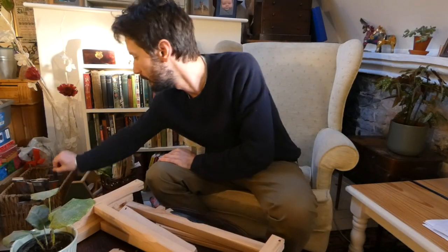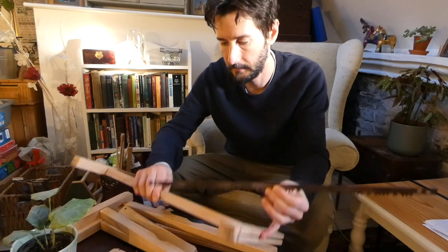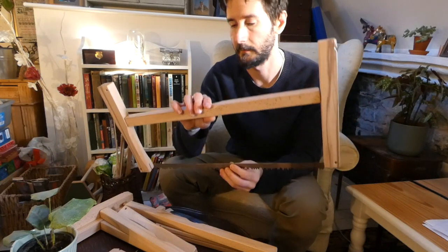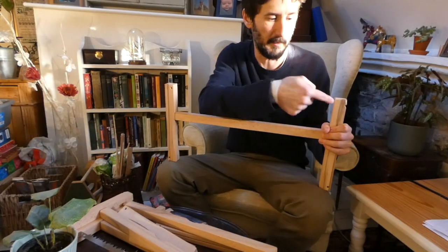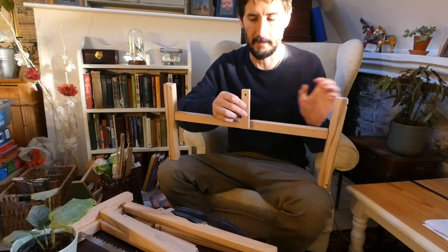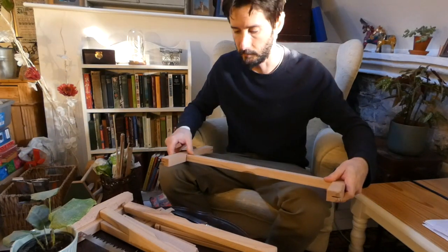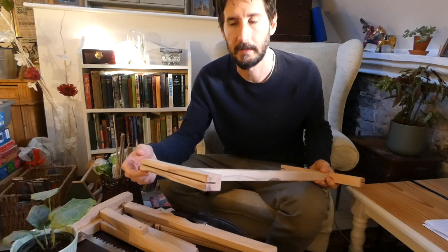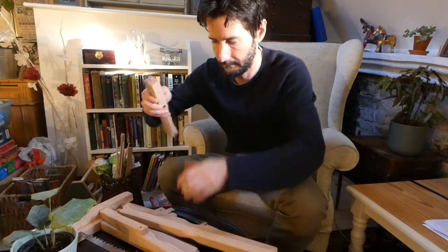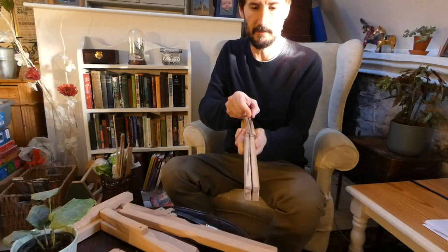When these are finished they'll have a saw blade on them. This is just a bow saw blade that comes across here, which I'll fix in with a nut and a bolt. And then across the top there'll be a cord, connected to what I think is called a windlass. Then you twist it around to tension the string and it tightens the saw blade. The saw blade will stay in place when you take it apart — you take the cross piece out and then the whole thing folds round, and the saw blade sort of lives inside the groove.